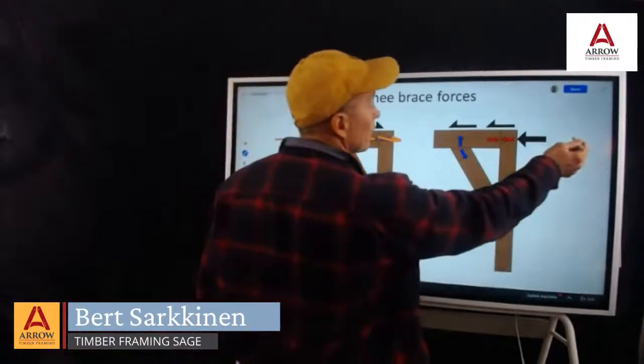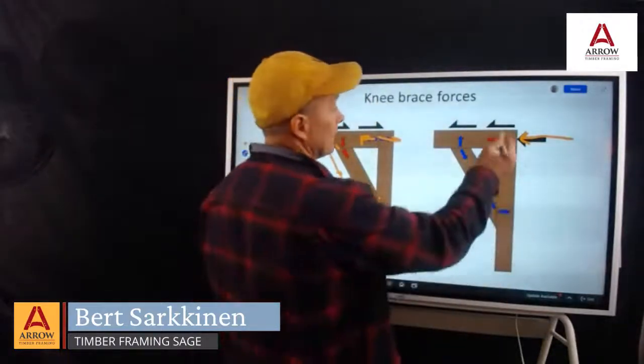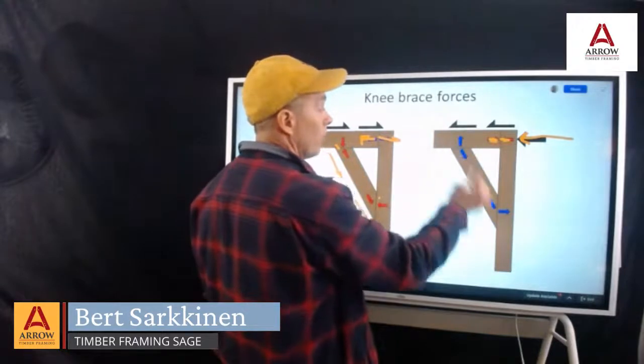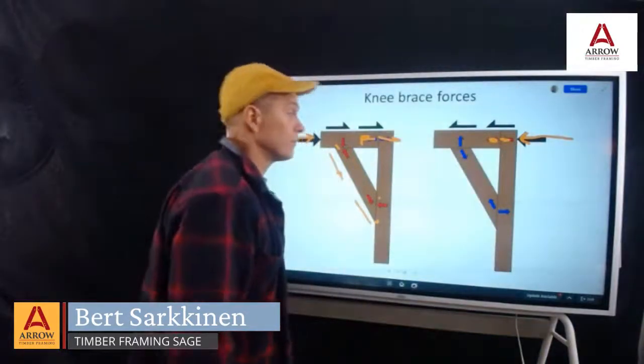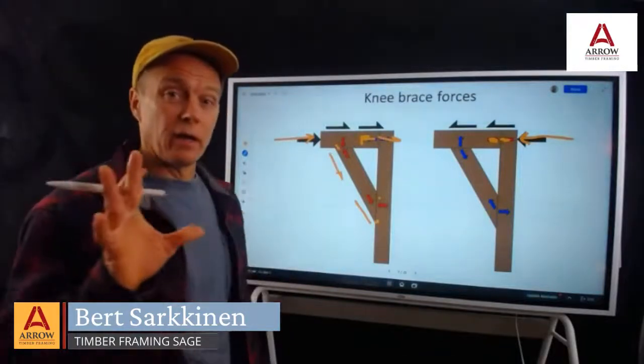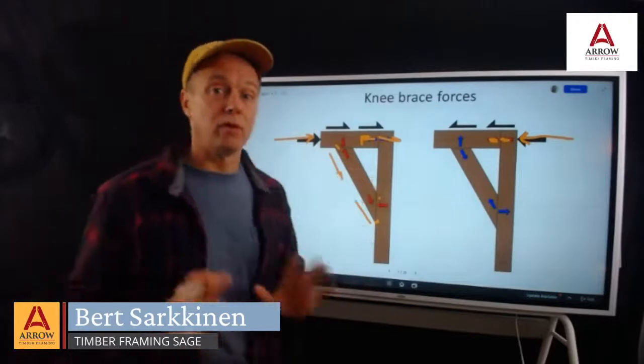In this scenario, it comes from the wind or whatever comes from this direction. Now this is just pulled tight. And now we're trying to pull apart on these two joints. So that's really, in timber frames, probably the most common way to address lateral bracing.